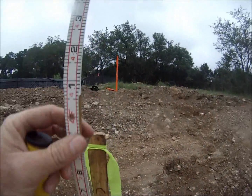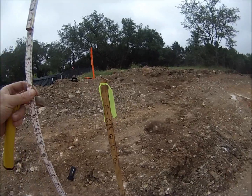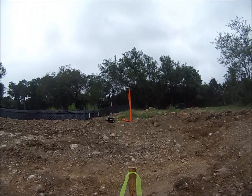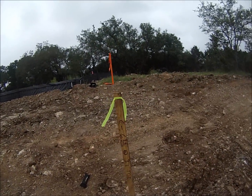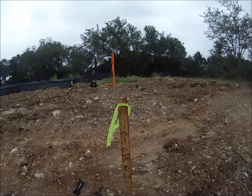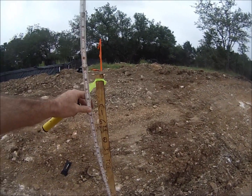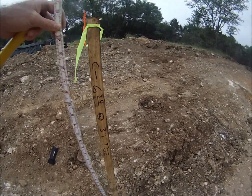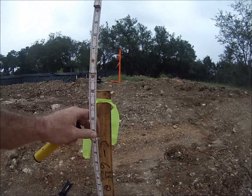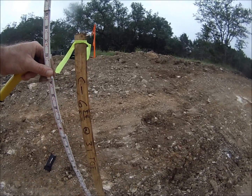At that point you would know that you have a three to one slope. With this four-foot elevation you're going to shoot for this next stake — since you're dropping down four feet in a cut of four feet, you can just take that four feet off of that stake right there and transfer it down. So the next time we check the grade, I could go ahead and pull out twelve feet and shoot four again, and the next one I would be shooting my four foot at that elevation. With that four foot down I now have at this station a cut of 6.54 at three to one to the toe.